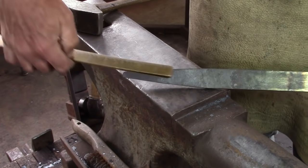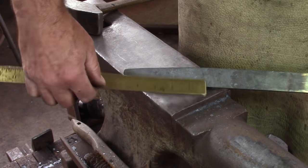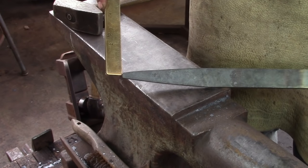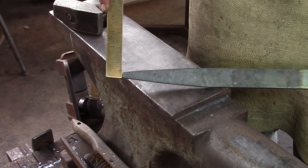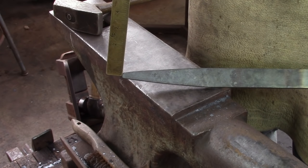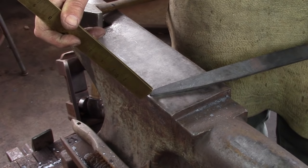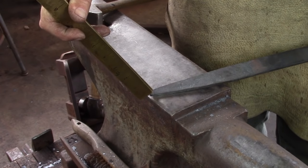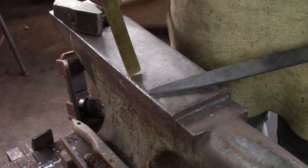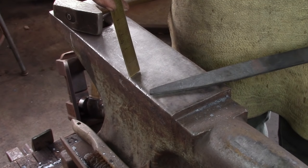The taper is about 5 inches long — you can see it starts about here, fairly straight, and I've left myself about 3/8 of an inch on the end. That's important: one, I can sweeten that a little later by leaving it thick; I've got somewhere I can park the chisel and have a look at what I'm doing. Don't forget you're going to lose some of this material to the chamfer of the chisel as you cut.